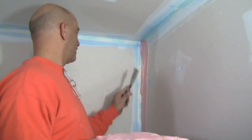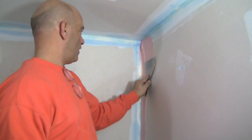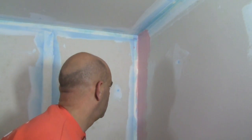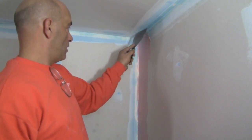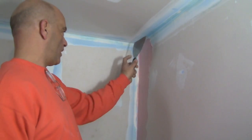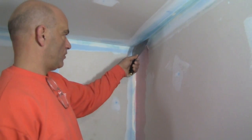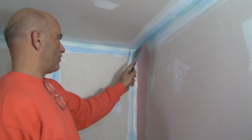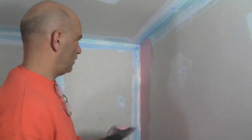See how I did this — I didn't have enough mud up there, so let's get enough up there, press a little bit harder, and clean it off nice and smooth. Right here looks okay, but right here not so much. We don't want to go flat over with the knife because then we leave a nice line. So put pressure on the outside edge where it doesn't matter, lift the knife a little bit so it feathers — I've got my finger on that side putting pressure — and that's it.